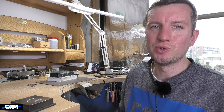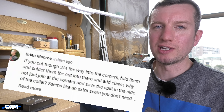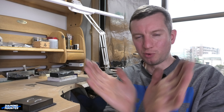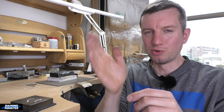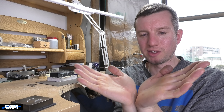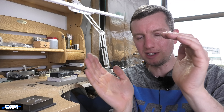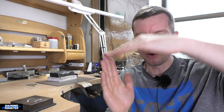Welcome to Diamond Matt channel. This video is an answer to a comment on one of my previous videos from Mr. Brian Monroe. He was asking a good question - querying why I make a collet the way I do. What he was talking about is a four-corner collet. I've got my strip of metal, I cut and groove out the inside at 90-degree grooves so they fold up into nice corners, and I do that four times. He asked why I don't have my join on a corner.